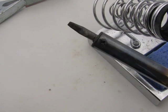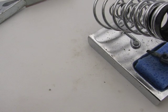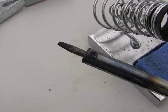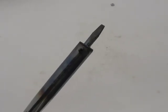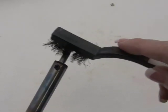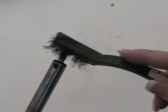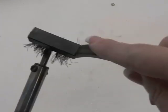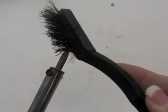This tip's not completely gone yet. I can probably go ahead and clean this up. I wipe it off again and see - nope, no silver. So what I need to do is turn this off and let it cool. There are a couple of different things you can do. One, you can take a brass bristled brush and scrub it off, rubbing it on there really good until you start to see some silver underneath. This one is pretty bad though, so a bristled brush is not going to cut it.